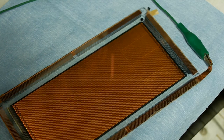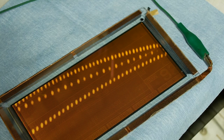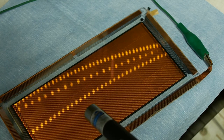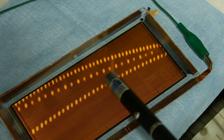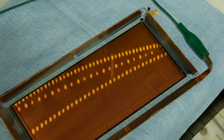For this demo, I'm going to swing the laser pointer very quickly by, and as you can see, it's dotted. As it turns out, we're powering this display with alternating current and the frequency is about 1700 hertz. The pitch of the dots matches the frequency of the drive. It makes sense — when the voltage is near its peak, we get this effect where the ultraviolet hits the panel and we get persistence. When the AC cycle is near zero, we don't get this effect and it's dark. Even more interesting, the pattern has an ostinato — big dot, small dot, big dot, small dot — which tells us there's some kind of asymmetry physically in the panel. The laser pointer isn't getting brighter and dimmer, and the AC waveform is balanced, so something physically in the panel is asymmetric.